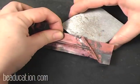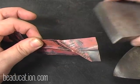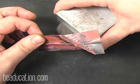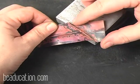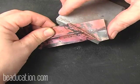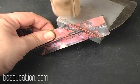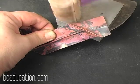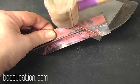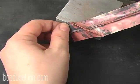So what I'm going to do, I need this a little higher so I can get my piece down there. So I'm just going to stack it on another one. And see, I have that crease there and I'm trying to get rid of this dip right here. So I put that on there. I use a soft blow. And see that opened that nice and neatly there. And the same thing here.